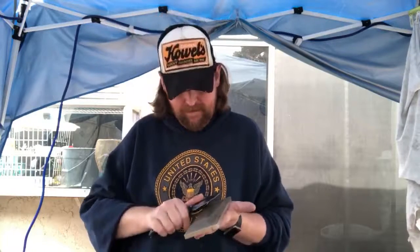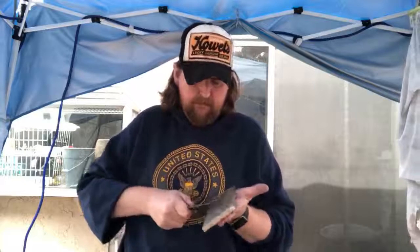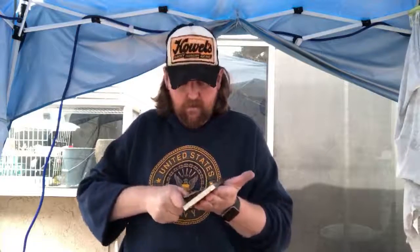Well, there's a lot of guys, and they quest for that super, super thin edge. But the problem is, that's not great on everything. Well, my knife won't hold an edge now. Yeah, it's because you went too shallow on it. It doesn't have enough material to support that edge. Then your edge bevel looks really fat and wide. Now I do have to admit that there's some things you can get away with that super thin edge on, but not something you're going to do much cutting with.